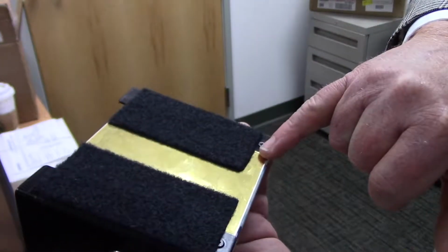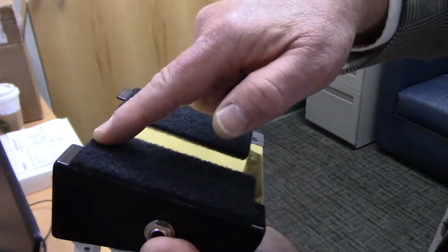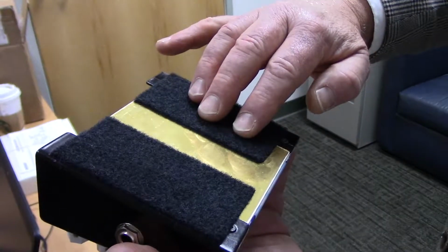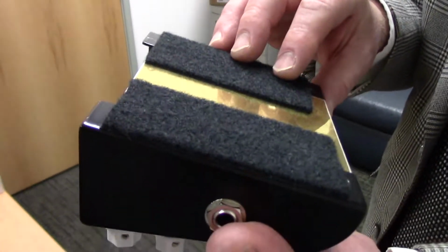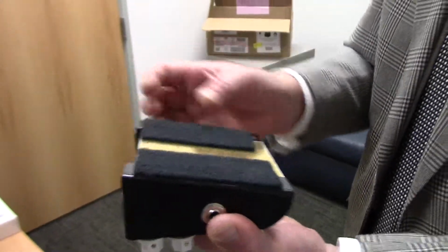The friction of how it's stuck in here, and double-sided tape along here and here, and then your tape for your pedal board is what holds it all together. And it covers the little plastic screws so they aren't going to work their way out, and it can still easily be opened back up. You'd have to just tear the tape off, unscrew the screws, and it can swing open. Really, the only time people have their pedals open is to change the battery, and we opted to go with no battery since there was no room, and since you don't use batteries on your pedal board.